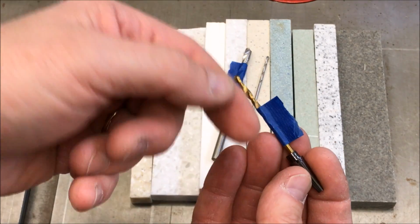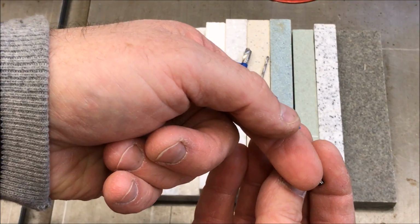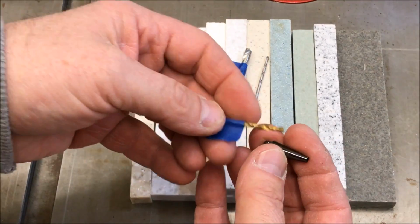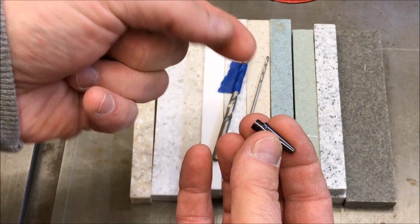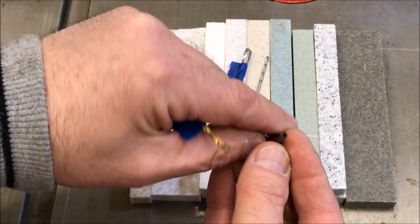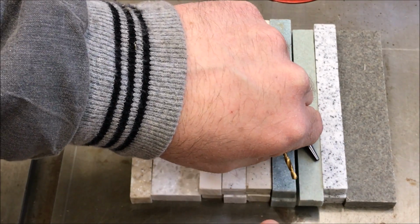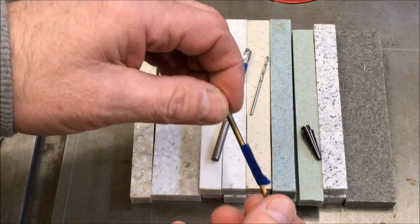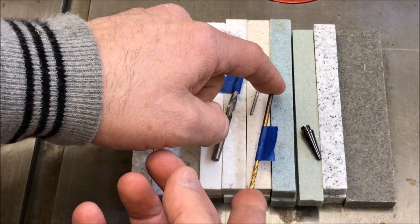So what I'll have is a 1/8 inch hole all the way down through the nib, and then at the end I'll have my 3/16 hole, and I think that the ink cartridge or the ink refill should move nicely back and forth through the hole at the end of the pen. 1/8 inch is larger than the ink refill, so I think everything should fit and work nicely.